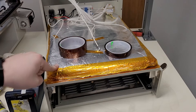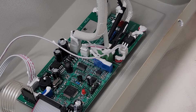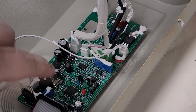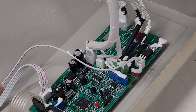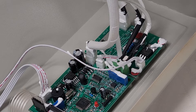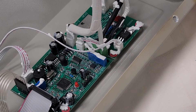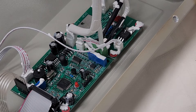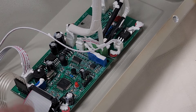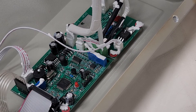So let's move on to the next part of this project: installing a cold junction temperature sensor for the controller. The new firmware we're going to upload into this microcontroller will have the ability to read a cold junction temperature sensor in order to figure out what ambient temperature is, instead of what it does now, which is just guess at what the ambient temperature is — there's a hard value programmed in. With this, instead of being 10 to 15 degrees off, we can hopefully get down to about five degrees accuracy and have a lot better results when we reflow our boards.